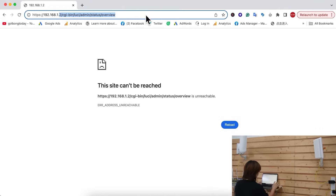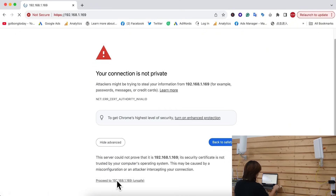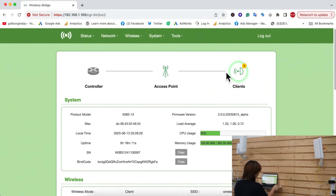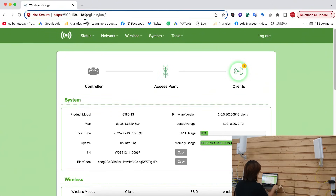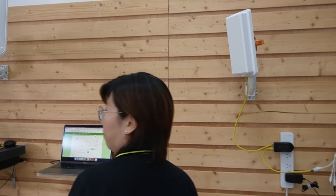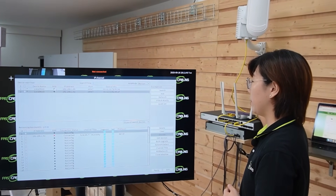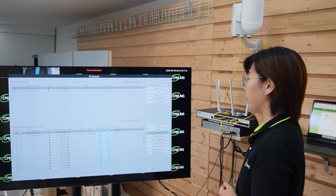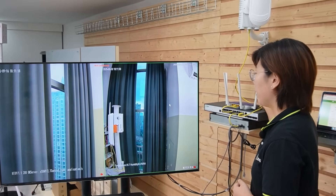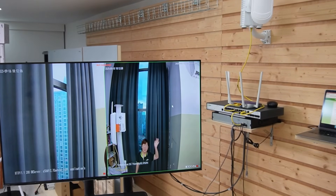I'm ready to change the IP address — let's type in 169 here. Type in the password again. Our client bridge is now connected. Let's reconnect our IP camera and see if we get the video feed. Moving over to the network video recorder, let's search — I'm seeing two cameras coming up. Let's add them to the network video recorder. Now we have two cameras live. I'm going to wave my hand so you can see the first one and the second one. The whole system is live.